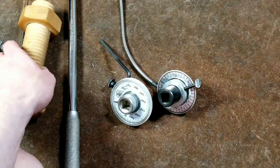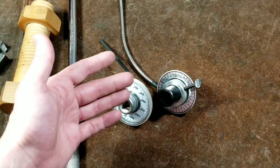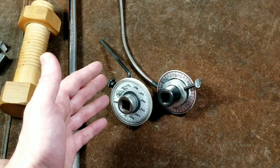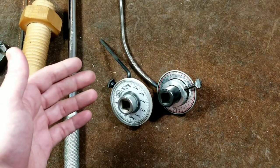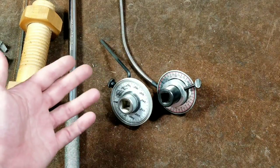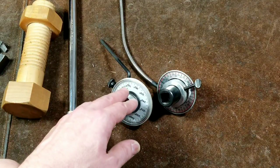And that's an issue with direct measurement torque wrenches — click type, split beam, digital torque meters. None of that matters, because all you're doing is spending a bunch of your efforts measuring just how much friction is in the fastener, rather than applying actual clamping force. In a small gasoline engine, you might apply 50 foot pounds to a head bolt and then turn it 90 degrees.